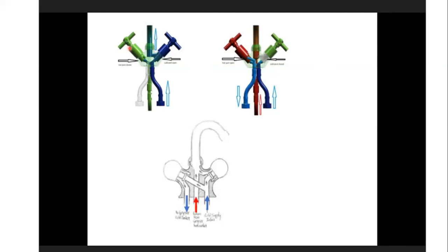When you open the hot water, the head part releases off the side. The water flows in, it flows down. Remember, the hot water pipe connection of the mixer is connected to the cold water of the geyser. So the water is flowing in, going past the hot water head part, the washer, and it is pushing it down into the geyser. That's why it's called a push through. It's pushing it down into the cold water, and therefore the hot water is now being released through the middle, and it's pushing it up through the spout.